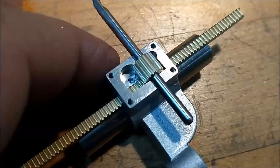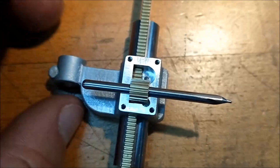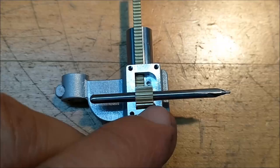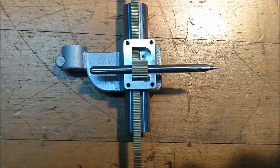And if this is one of the ones that intimidates you, justifiably so. There's a lot going on, and there's a couple of impossible features on the print that the engineer skipped over. We have three square corners. Two of them are through corners that can be broached, yes. But this one down here is a blind pocket corner, and I could do that as well, but it's just easier to undercut it as such.